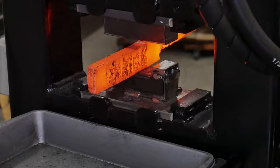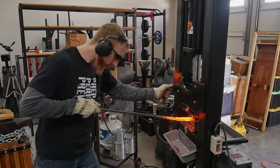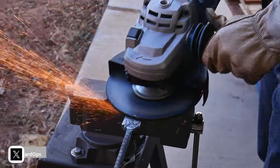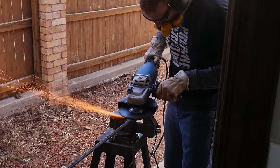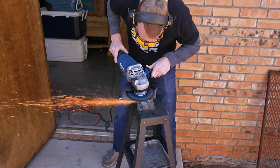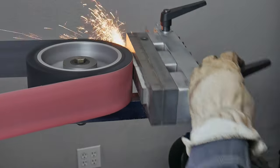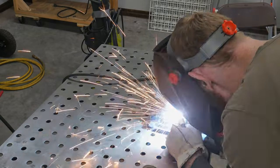The real name of the game with the cutting and stacking iterations is reducing material waste and reducing the amount of grinding you need to do. Having flat billets with a consistent thickness goes a long way here. I'm basically grinding until I have clean steel across the whole length of the billet. After rough angle grinding, I cut these billets into 8 equal pieces, surface ground them, and restacked into one large billet that will yield 72 layers.